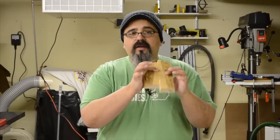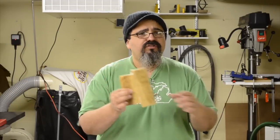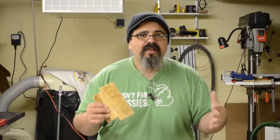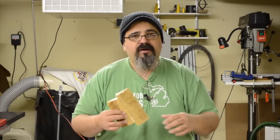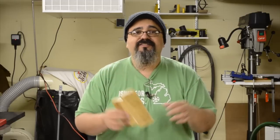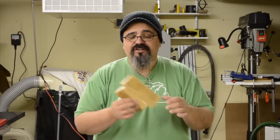Preferably your glue should be at room temperature — follow the temperature range recommendations on the bottle. Bring glue inside to keep it warm, then take it out with you. It only takes about 20 minutes to two hours for glue to set enough to come out of clamps. When you have a glue-up, set out a space heater or move the piece to a slightly warmer area — maybe a closet or a small lean-to with a heat source — to raise the temperature to the glue's minimum recommended range for a couple of hours.